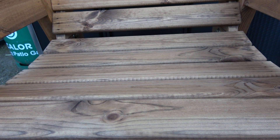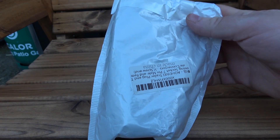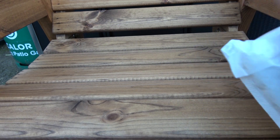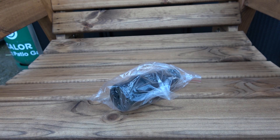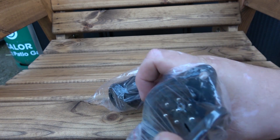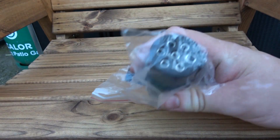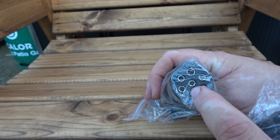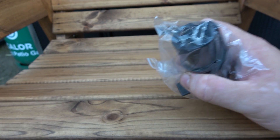Before I show you the train running, I'll quickly show you how we're connecting — as I've shown you for the rye run — the bits in this bag. It's a trailer, a plug-and-play T-bar. We found this on Amazon — you get a plug and a socket, so when the equipment isn't in use we just disconnect the cables. We have one of these on the layout end, which is a really useful connector, and one on the end of the cable. The way we're running it is DCC along those two, 16 volts there, and then that one is a LocoNet ground.